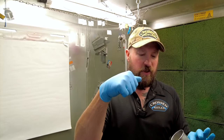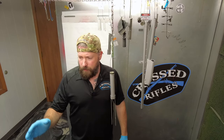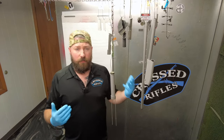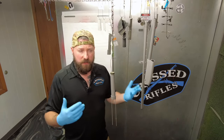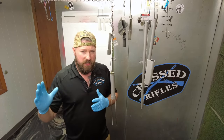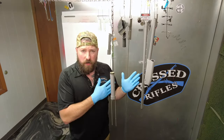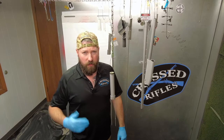I'm going to clean the gun out — spray it with some acetone, hit it with air, make sure there's no particulate inside, and get it set up ready to spray. We've got gold today. We're spraying some parts gold; this is actually a personal shotgun I inherited from my father-in-law when he passed away. I'm redoing it so I can give it to my wife — it was her dad's and it'll get passed down to my son. It was pretty beat up, so we're just going to redo it in gold.